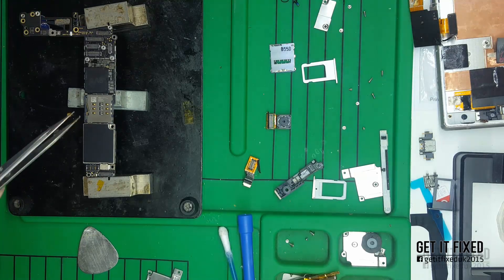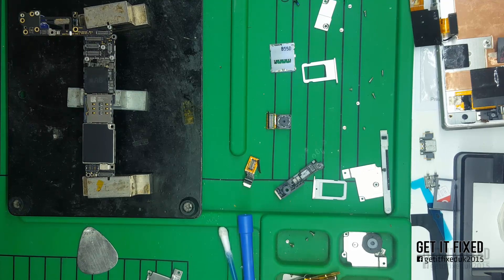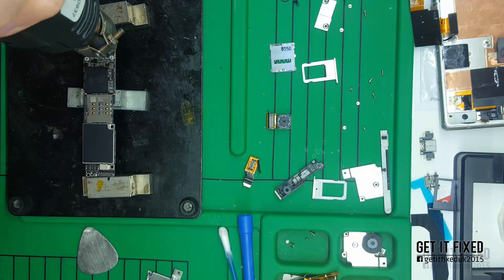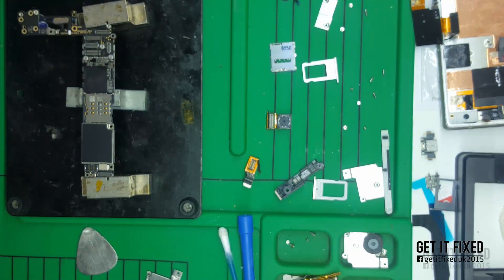Make sure you put a bit of flux — this flux is not the best one, I'll show a different kind in next videos. Make sure you cover the A8 CPU because if it overheats you're in huge trouble, as it has many ground points underneath on the BGA. But if you have the skills to work with high temperature, you can do it even without covering — just take it off really fast.